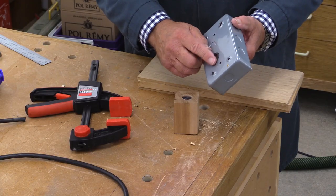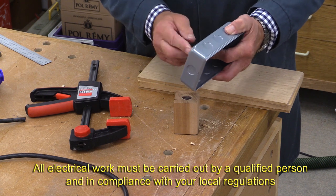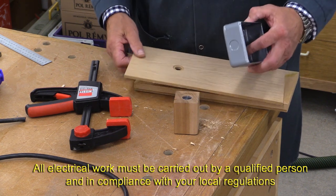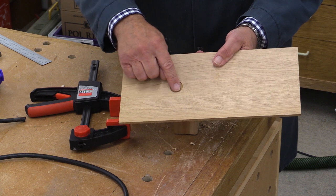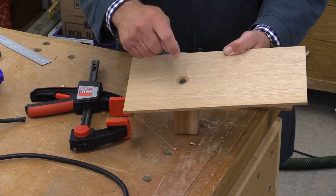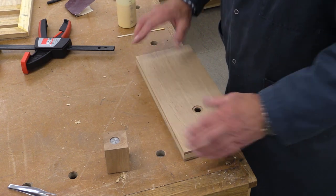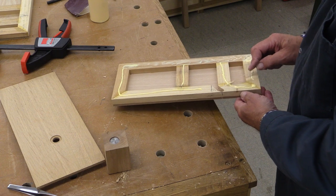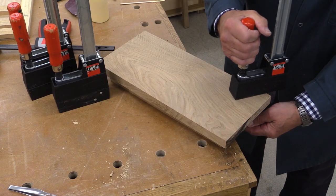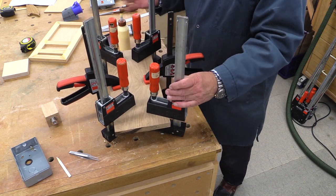I've put a protective rubber grommet which fits into the hole in this metal box and it protects the cable from chafing on the side of the metal. Because that is slightly proud of the flat surface on my piece of veneered MDF, I've put a counterbore sufficient to take the part of the washer that sticks out, and then a hole through the centre for the cable. I'm now going to go ahead and glue this panel on the other side. That's absolutely fine - I'll leave that for the glue to dry and get on with the other one.